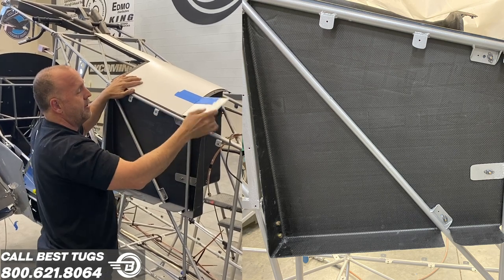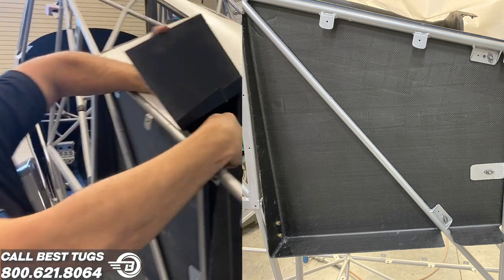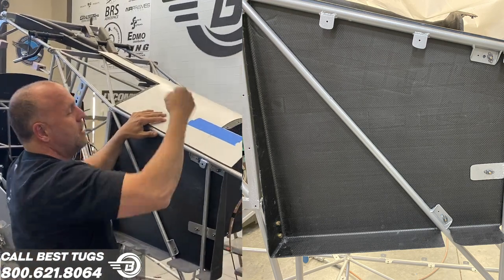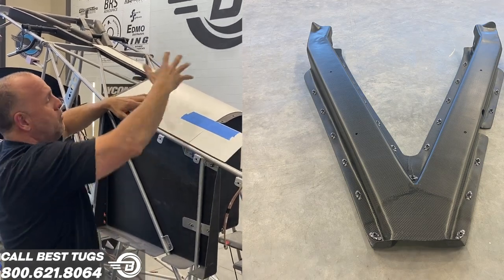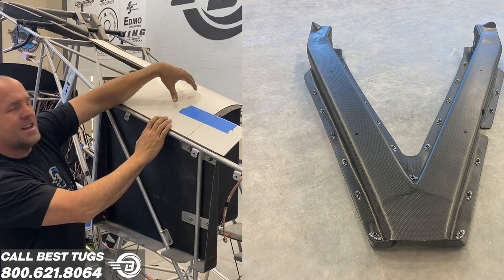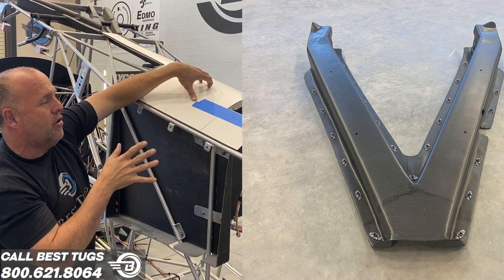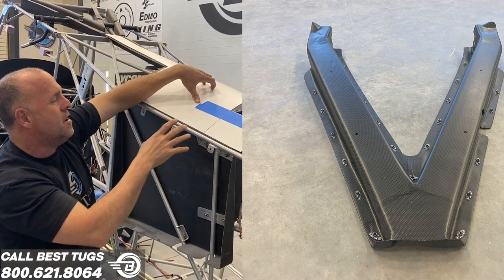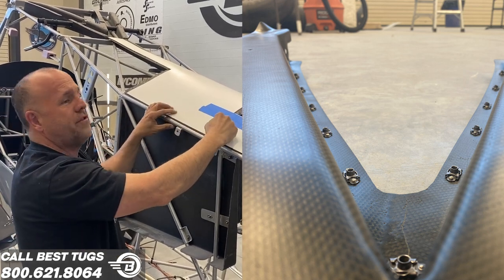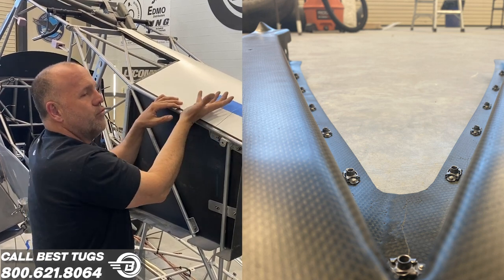As that gets up higher, there's a little loop right here you can see. It passes through into the parachute box. That's where the cables will sit. And as soon as they go tight, it will then pull the rest of this top off. And I actually need to lay up on the backside of this. I'm going to do 10 more layers of carbon fiber. It's more than the specs call out, but there is a fail point if you don't do this area strong enough, and that's the cables tearing through this lid rather than ripping the lid off.